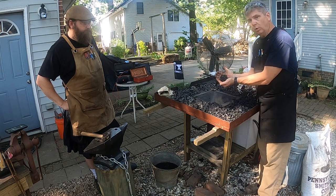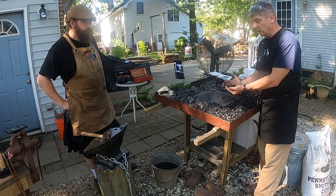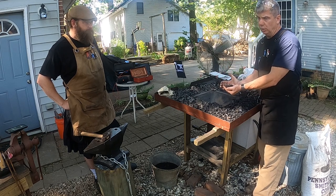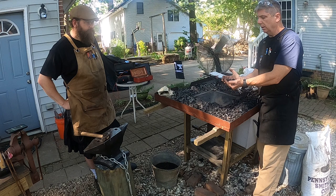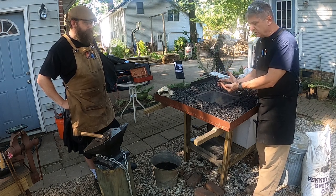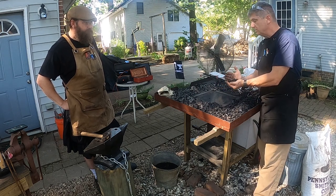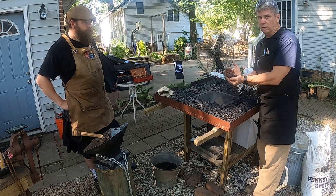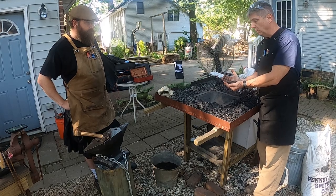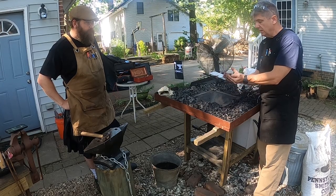It's a higher grade of coal than what people often burn to heat their homes. It's sort of a specialty coal. It burns hotter than home heating oil. Anthracite coal is a harder type of coal. But this is called bituminous coal, and not only does it burn hot, but it produces very little in the way of those waste minerals that I'm telling you about, that's called clinker. The higher the quality of coal, the less waste or clinkers it produces.